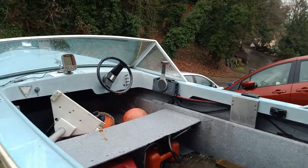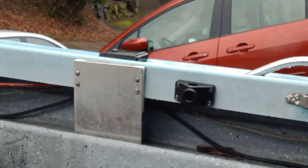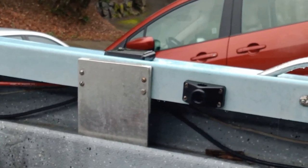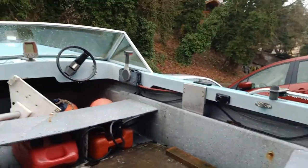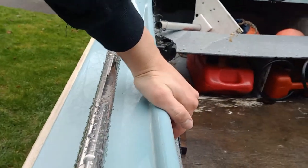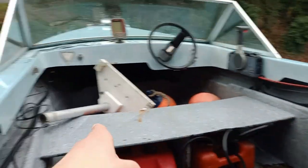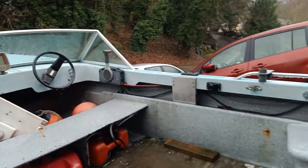In the boat there's a bunch of junk over here. That was a crab pot puller attachment, but it actually supports that side deck because these side decks originally don't have much support. As I'll show you here, they are just some wood backing in there, and this one isn't super strong. They made a cutout here to do another one, and I want to finish that project to make this side deck stronger.